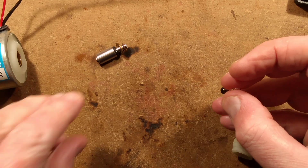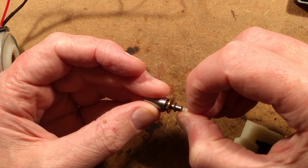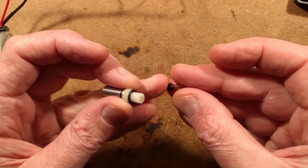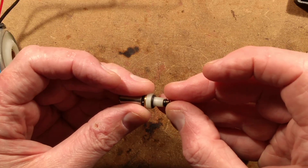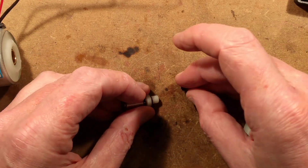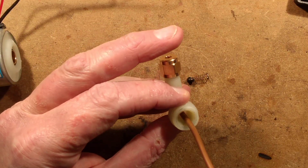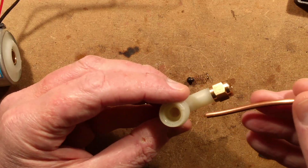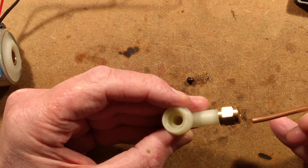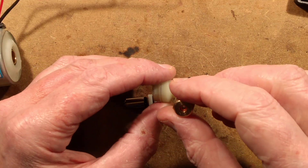This is the other valve. The first valve is the little springy thing on the end of the piston: as the plunger retracts against the liquid it pulls open and the liquid flows in. Then as it pushes into the cylinder, there's a simple spring-loaded plunger sitting against the exit hole — as it pushes in, this plunger is pushed back and lets the liquid out, and when pulling it seals. If you've got the metal body version, a prime place for corrosion and blockage is right in here. Get something thin like a wire and poke it through — you should see it appear down inside. If not, there may be granulated deposits built up in the corner, which is more of a problem on metal versions than plastic ones.